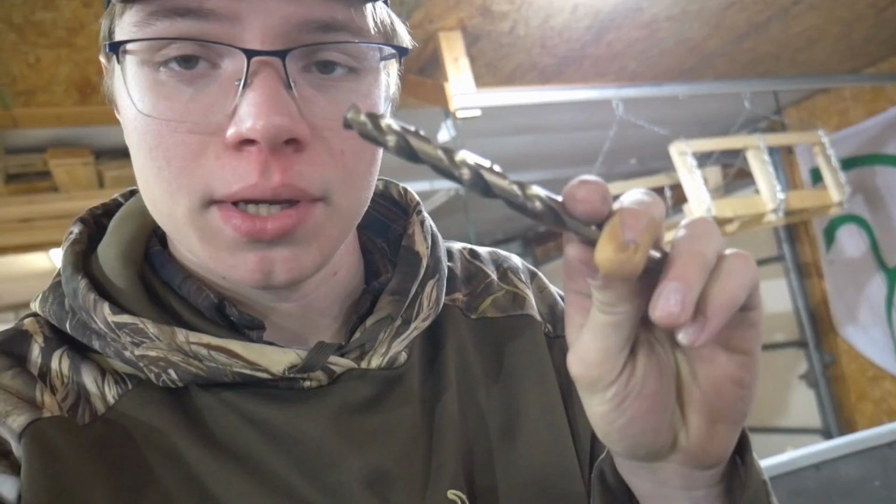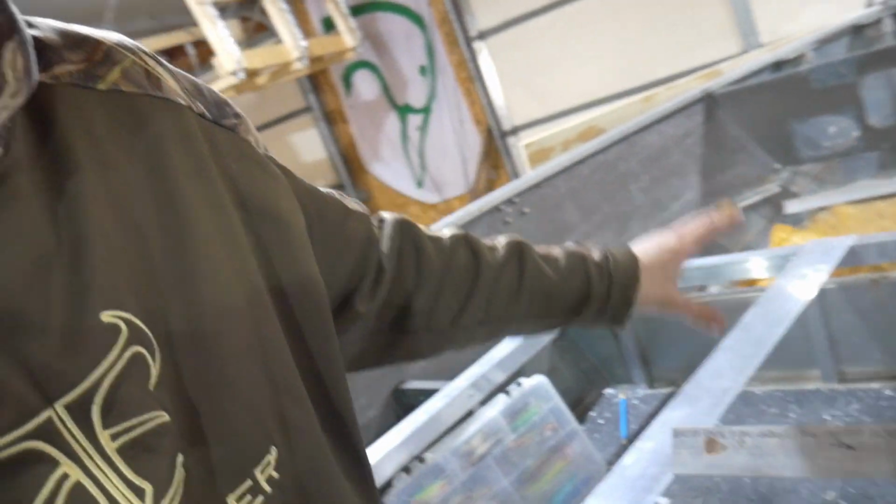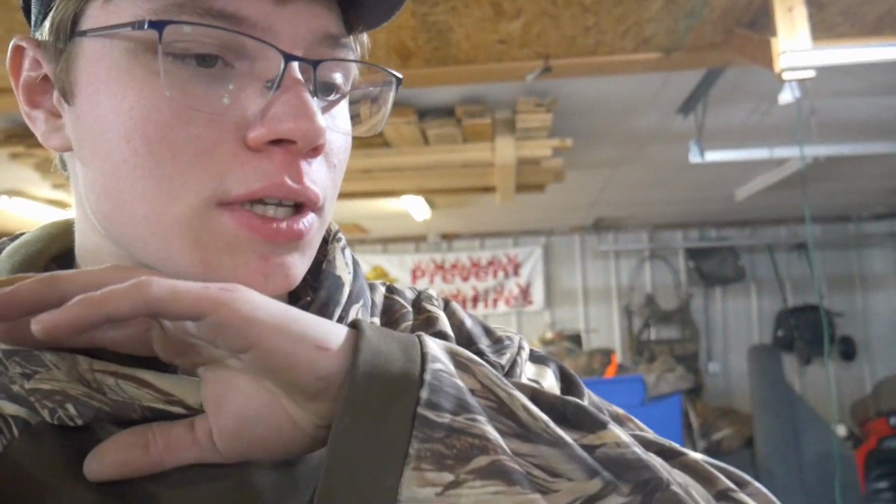I've also been deburring all of the holes that I'm drilling with a bigger drill bit. I'm basically just trying to get all that crud out so that I'm not sandwiching any chips in there, so everything's fitting flush, and when there's going to be load on this, it's all going to be able to disperse over as wide of a surface area as possible.